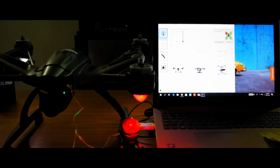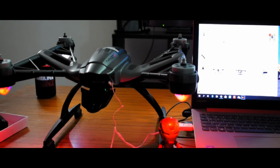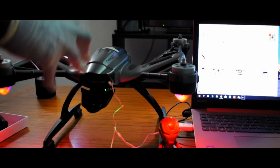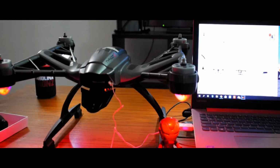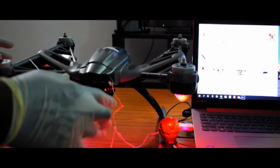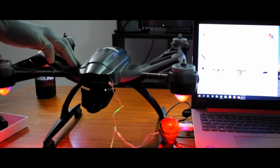Okay, Mr. Mike, on this section of the software, we're going to now do a test of all the motors. So, check mark enable testing. Yes, there is. Always make sure whenever connecting your quadcopter to the GUI, the best way to do it is with your propellers removed, in case of anything. Yes, the drone will still be grounded and no accidents caused. Exactly. Click on ESC ID assignment.